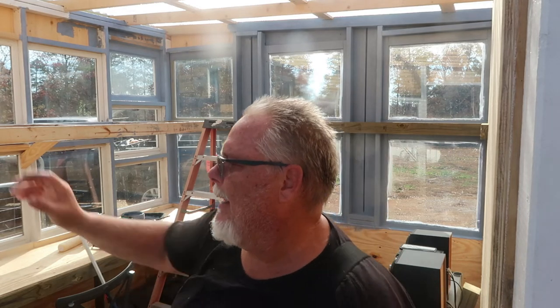Basically, the reason why I'm painting it, let me tell you this. Some people argue with me, but I always use an exterior latex paint in my bathrooms. And why? Because of moisture buildup from showers and taking baths, and there's a water base in there. If you use an exterior paint, you don't have to worry. It seals up a lot better than the interior does. So just remember that when you're buying paint and you're going to do something like paint your bathroom, use an exterior. Trust me, it'll work a lot better. It's the same price. I mean, no difference in price that I know of.